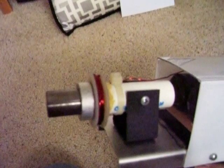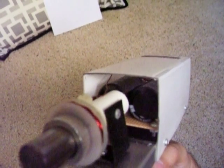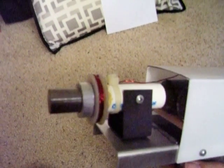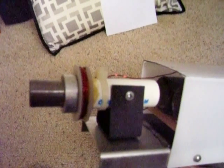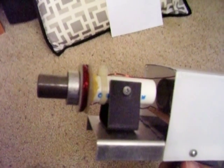This coil produces a magnetic field because a lot of current is going to be generated inside of it. This current comes from these two large capacitors inside. Each capacitor is going to be charged up to 300 volts, giving me a total voltage of 600. When you have low resistance and high voltage, this produces a very high current, and this current is going to exist for a very short time, so this magnetic field is going to be very high and very quick.